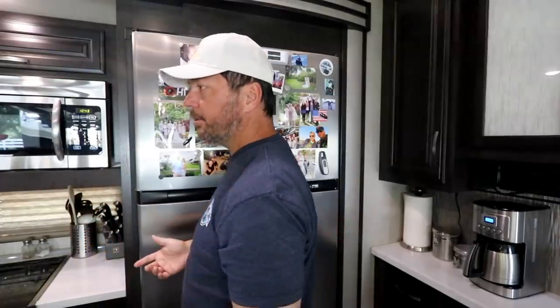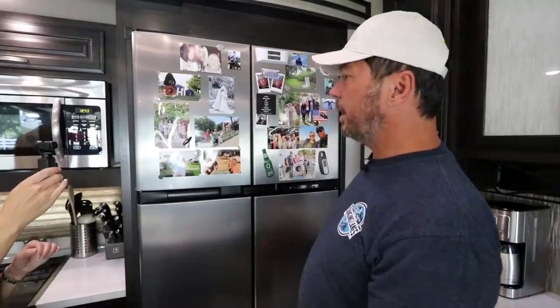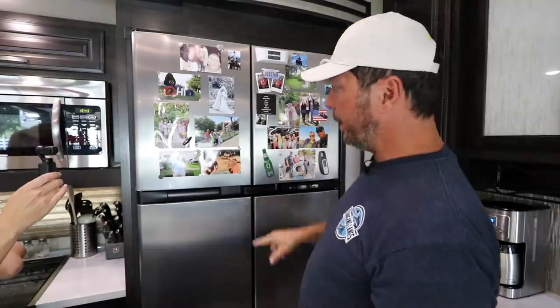Pretty good? Yeah, it's just sort of a feel thing. It's not grabbing or sticking, and it's not just zipping through with no resistance. It's kind of even. So the dollar bill check is good to use if you're having a problem and you want to check your seals. We're not having a problem, so we're not going to check all the way around every seal.